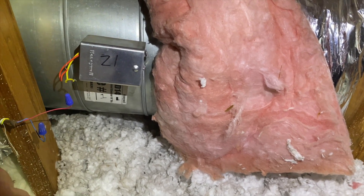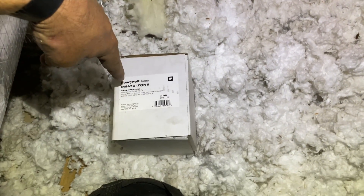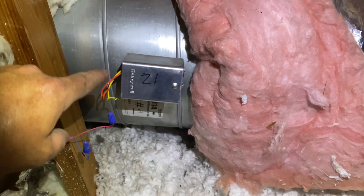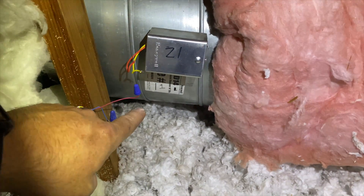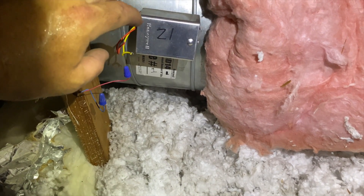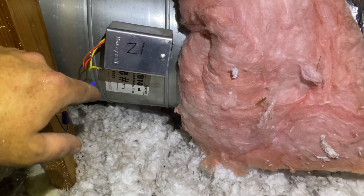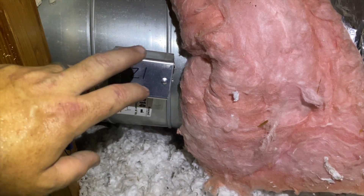That's why I just disconnected it. We've got the new one — this is the M8470 zone damper motor. These operate on 24 volts. Right now I have zone three enabled with just the fan running, so it's going to send 24 volts to close this zone and I can test the new one. I'll hook it up, it'll close, and if I remove power it'll pop open. I'll verify it opens and closes. The new one also has an indicator that the old one didn't have.